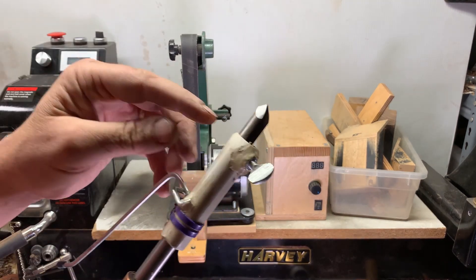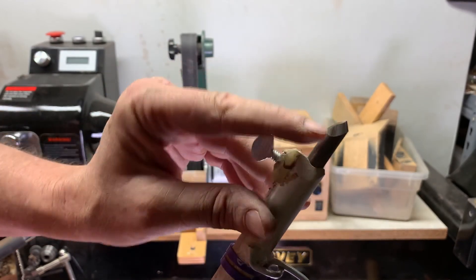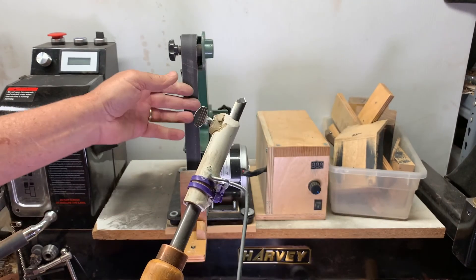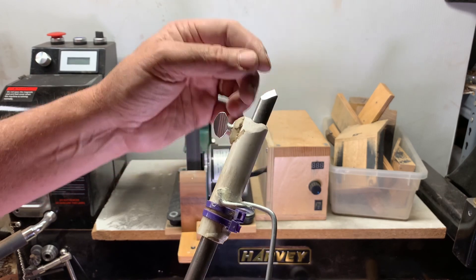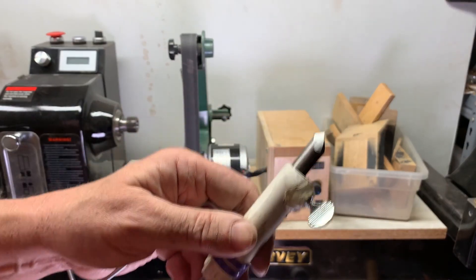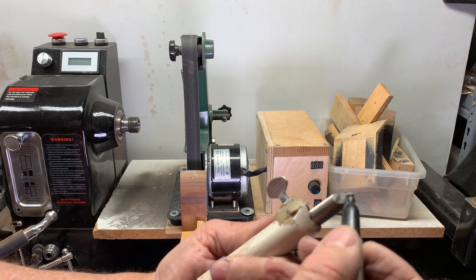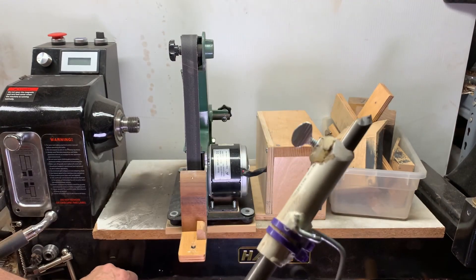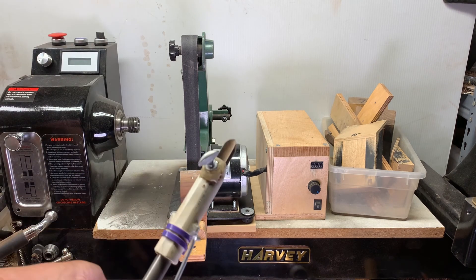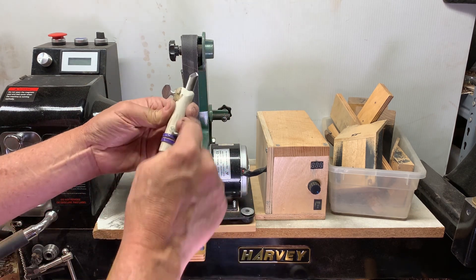There are a million tutorials on the best way to do this so you don't get little humps on the sides. You can see a little hump on that side and a little divot on this side — that's all about timing and how long you spend in any one place. If I spend more time at the tip, the tip wears away and I'll end up with a hump. I need to spend more time back where it's humped out, and less time where it's dished down. The single hardest thing about sharpening a bowl gouge is the timing of going around. Not the jig, not the tool.